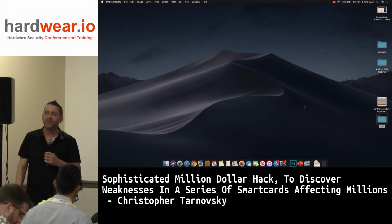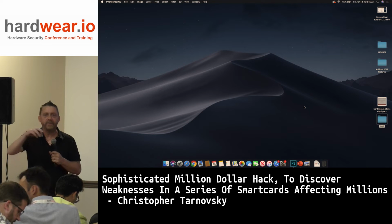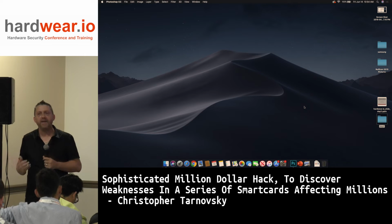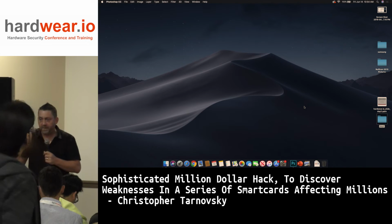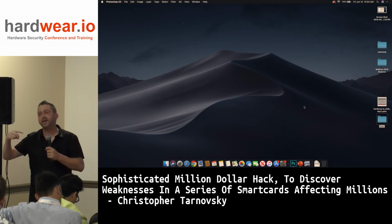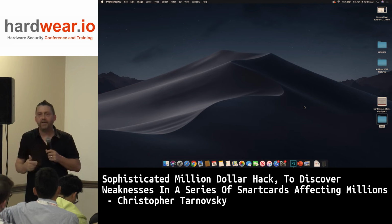At first, I didn't know what flip-flop 2 was for, and I'm like, all right, I see the data bus going into logic. This looks like it's the instruction register, but what's the second flip-flop for? And then one day I'm just like, well, let me follow it. Let me see where one of these bits' outputs goes. And then I realized it goes into an XOR, and I noticed flip-flop 1 merged with that same XOR as it continued onward, and that triggered that.